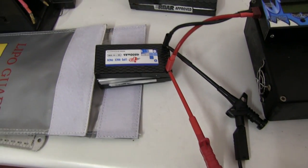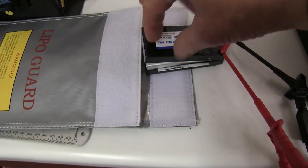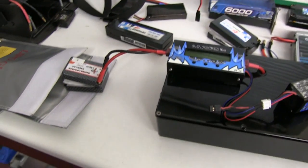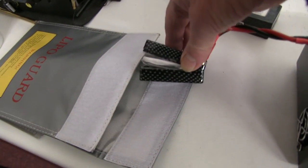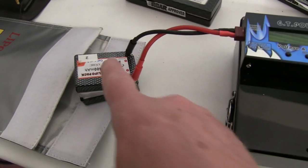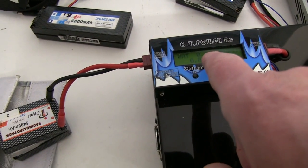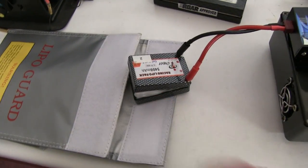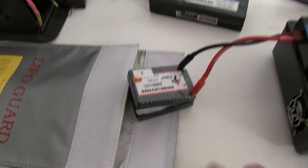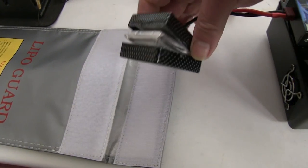When I disconnect the resistor, I'll see if any voltage recovers before we take this apart. Discharging this battery down to absolute zero volts — even when it gets to zero, it really does swell up. This is quite warm. Even though it's been on a while, it's still generating a bit of current, 0.4 amps, and a tiny bit of voltage — that's got to go down to zero. Before opening, this would need to be totally safe, as any residual energy will cause some puffs of smoke. It's amazing how much energy they can just keep squeezing out even when it should be dead flat.